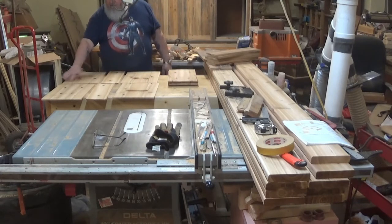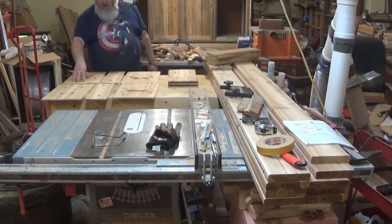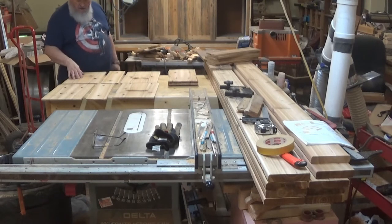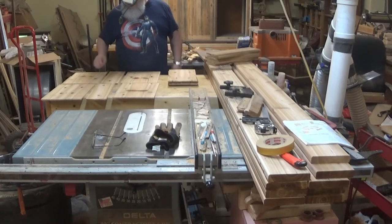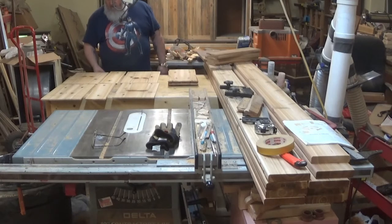Had a few cracks in the knots. So where there's knots, there's a few cracks. And so I filled those with brown CA, Starbond, medium thick, brown CA. Then I will finish sanding these to thickness tomorrow. I'm gonna let this dry for several hours, and I've got other things that I need to do this afternoon.